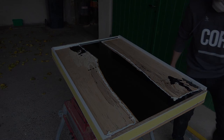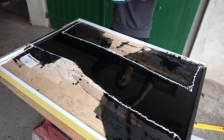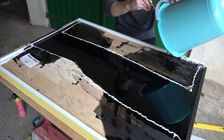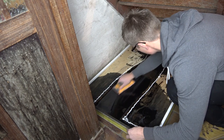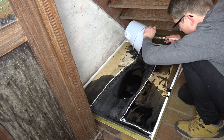All still went well up to this point, but then disaster struck when I had a brilliant idea to try and move the whole mold inside due to low outer temperatures in the fall. Spoiler alert — it went miserably. In what world did I assume you could move a huge mold full of liquid epoxy without it spilling all over the place? I lost about 2 liters of resin that day and had to do another pour. Not only did I lose money, I also stained all of the wood with black epoxy, which would lead to a huge loss of slab thickness later in the project.